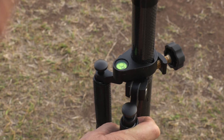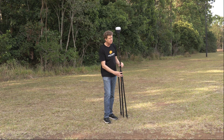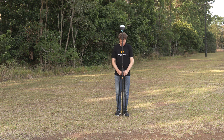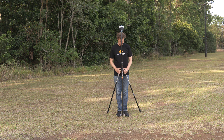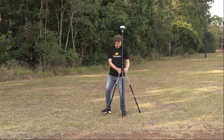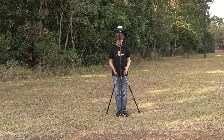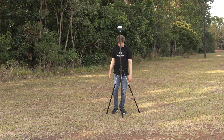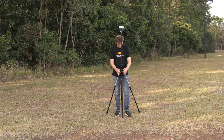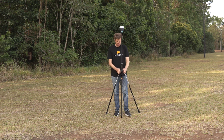I've also centered my bipod so that the bubble level sits between the two legs. By having the bubble level between the legs, I can stand between the legs — I've got a high degree of leverage and it's very easy to see what's happening with that bubble because I'm directly over the top of it. I can press the feet of the bipod into the soil for a firm grip, and then level the pole up. The feet have plates that let you apply pressure to plant them firmly so they stay in the ground when you move the pole.